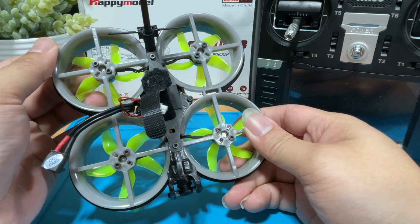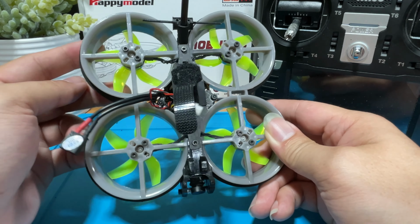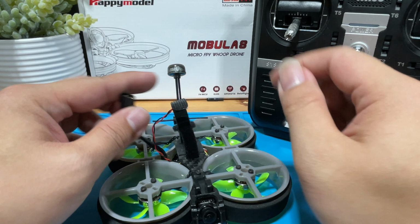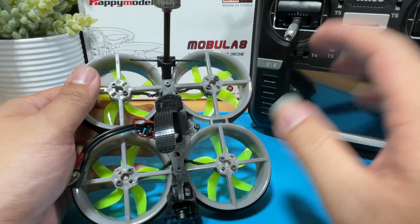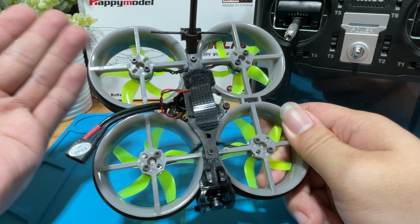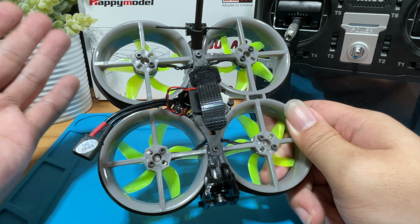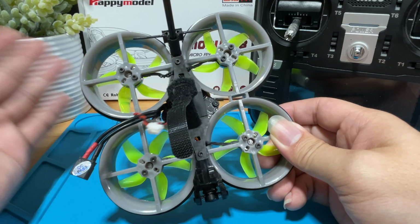Okay, so once you're able to confirm that both firmware matches, you will have two options to bind them. One is called the plug-in 3x method. Basically, you plug in your LiPo 3x to the quad and the receiver is going to be forced into binding mode, and you should be able to hit bind on your radio and they will just bind together. But the second, better method is to use a binding phrase. It's strongly suggested to use that as it makes binding much easier. In this tutorial, we will be using the binding phrase as my main method.